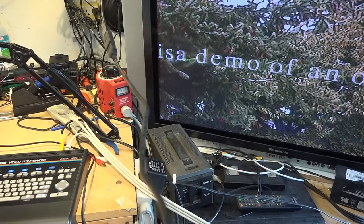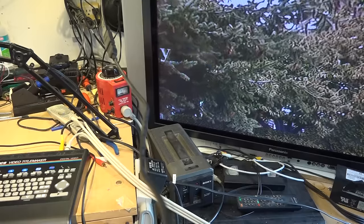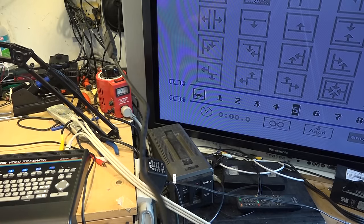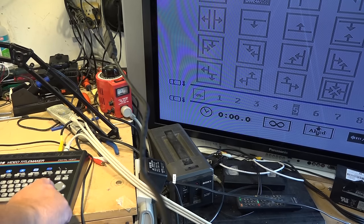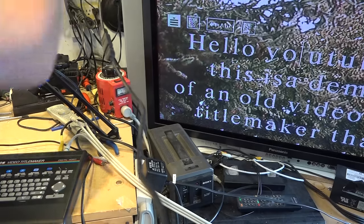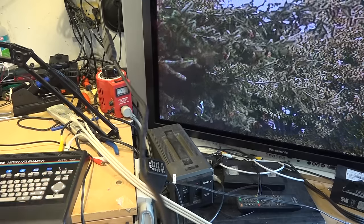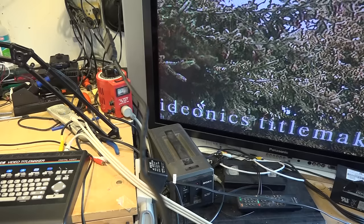And I can pick where I want. Yeah, I know I've got some mistakes in there. But if I want to pick where that goes, so if I hit new page and I go down here and I go into effects in and I select crawl, I know I can tell it where it goes on the page. Position, here we go. Position is down. I think that's the way I do it. New line. Yeah, down. That should be the bottom of the screen now. If I remember correctly, I can select center, top. I think that's bottom of the screen. There we go. You see, that's on the bottom of the screen. Now that's how you do a crawl on one of these Videonics